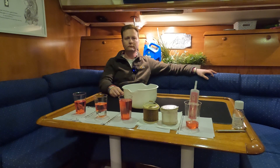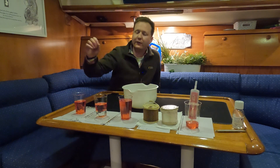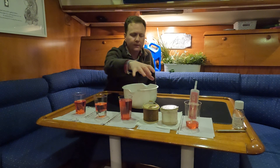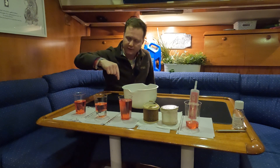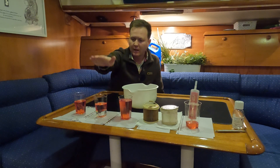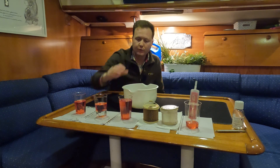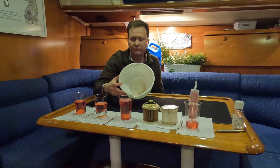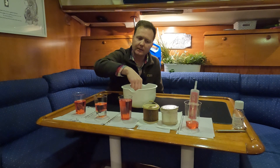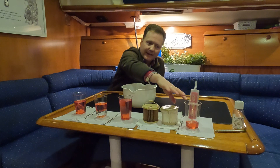After running the polish for about an hour, I'm just doing a little side-by-side comparison. What I've done is I've got the regular diesel, the diesel with water, and the diesel which was the drain-off from the main filter. I used this bowl and there is residue at the bottom - basically the leftovers from the bottom. And then you've got the filter that I used, an unused filter, and then the sieve.